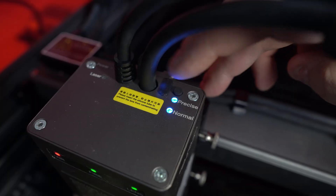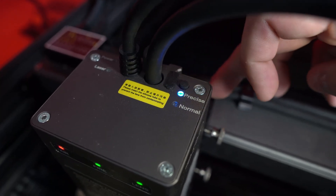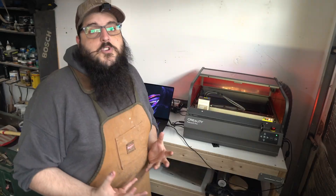There are two lights on top of the laser module — one for normal and one for precise. For precise mode it's at 20 watts, and for normal mode it's at 40 watts — 100% power. If you're looking to make projects that fit together smoothly, you might want to use the precise setting. It won't be as strong, so the laser line will be a little bit thinner.